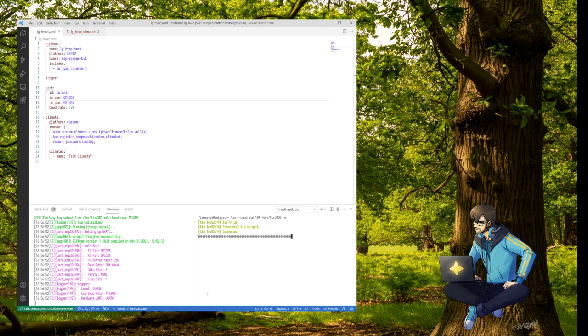I only need one more cable because I don't care about the receive side on the other hand, because it's going to mirror the same. These transceivers will mirror back everything you send over to them. So there is no reason for me to record what is received on both ends. I know that it works. I already checked that. So I only need 4 channels to record the whole thing.